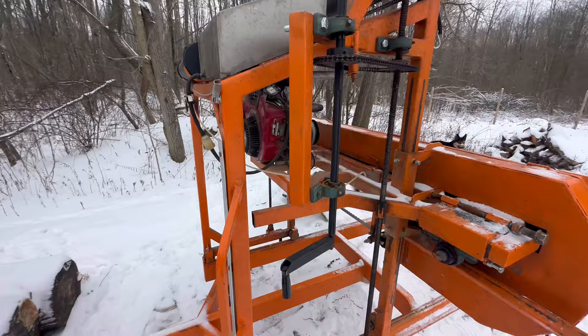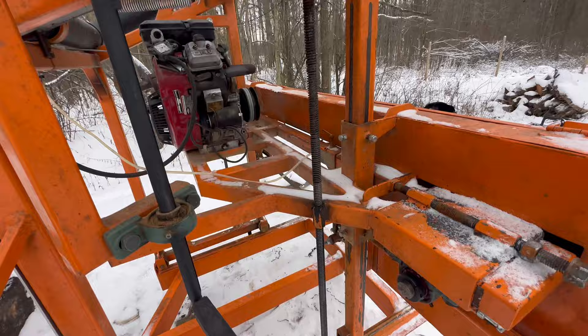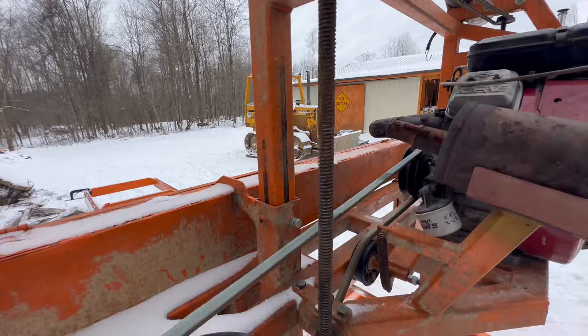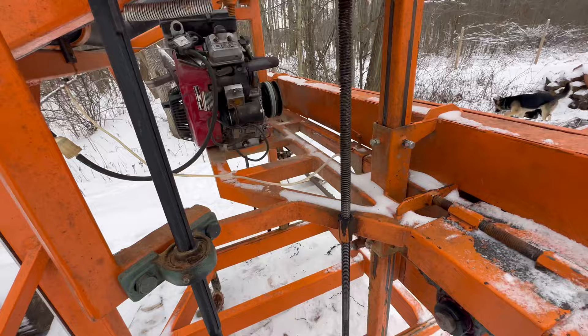Here's the up-and-down mechanism. I just got it on a hand crank, and that turns and I got it on some all-thread with coupler nuts welded on the carriage. There are some thrust bearings down here, and that's all connected to the other side — same thing. I got the ratio pretty good, it's not hard to crank, but after a while your arm gets a little sore.